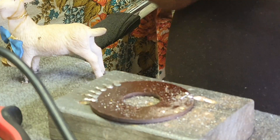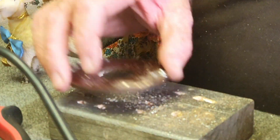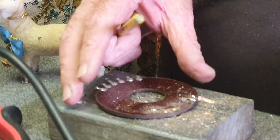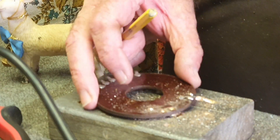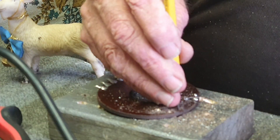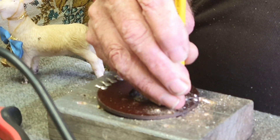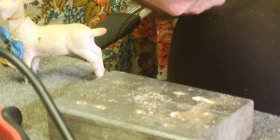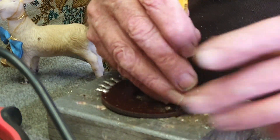There's the other one we're doing. We decided to do all the rivets on this — earlier I mentioned we may only do five, but we've found a few more rivets and we're going to do the whole six because that's necessary. We've got a hole drilled in the wood so the rivet drops down into that, making it easy to just punch it out.